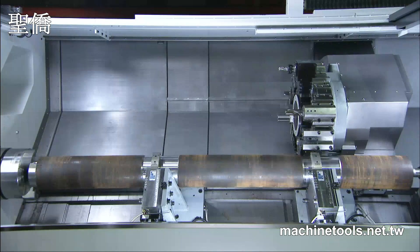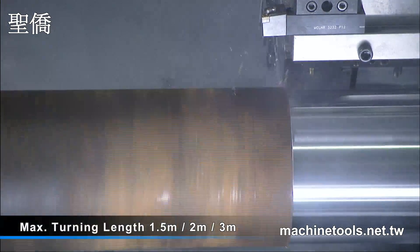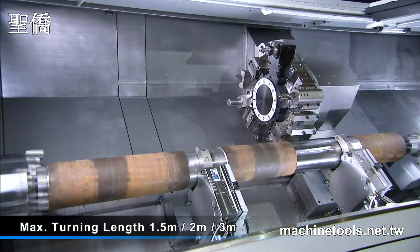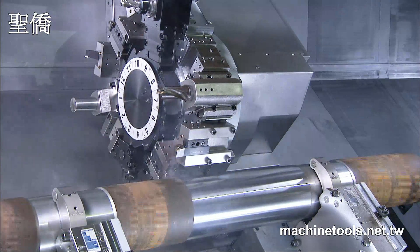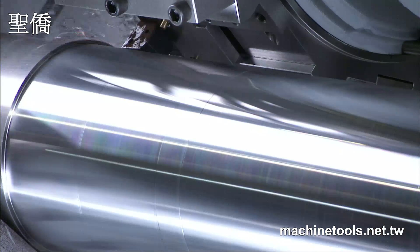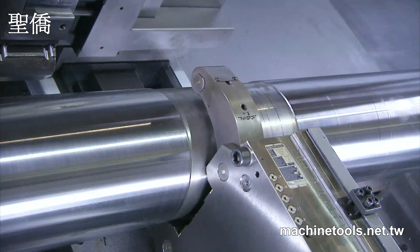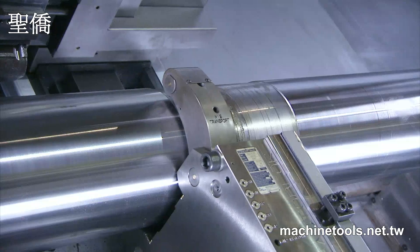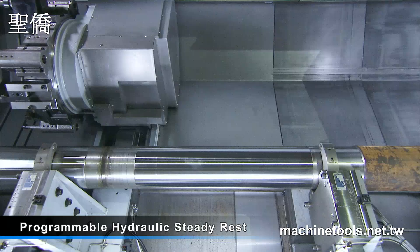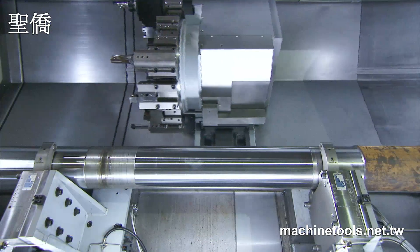Accuway provides the solution for your large diameter, long workpiece cutting needs. The UT400 comes with maximum cutting lengths of 1.5, 2 and 3 metres to suit all your long workpiece cutting requirements. To prevent issues of workpiece weight causing longitudinal deflection and impacting cutting precision, you can select a suitable movable hydraulic steady rest for workpiece support that can increase your production efficiency and maintain cutting precision.